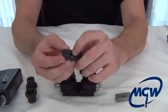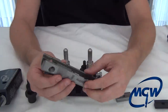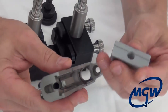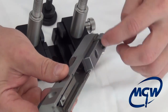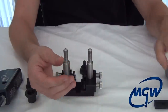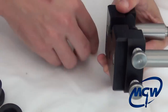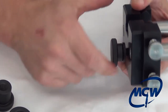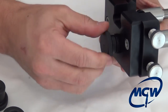Let's take our slide — this is the third generation Smith & Wesson 9mm. This is the clamp shoe for it and it slides right into the rails. It can go all the way to the front for doing the front sight. What we suggest is to put the shoe in the tool first, flip it over, take your clamp shoe, screw it in until it stops, then back it off maybe about a turn.